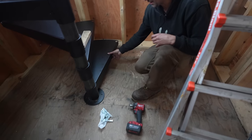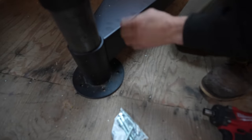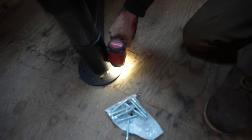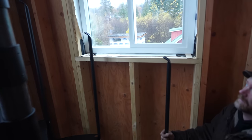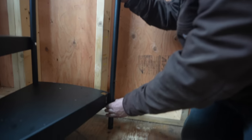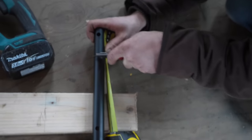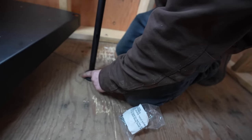Max caught an important tip: before you set your very last stair tread, make sure to set your lag bolts first, because if you set the tread you won't be able to reach the lag that's under it. For the final baluster, you have to cut it down to the correct height so the handrail isn't wonky at the end. Measure from the center of the bolt hole on the baluster down to the center of the step — in our case that's 3 inches to cut off the bottom. The kit comes with a base plate for the floor baluster to screw down.